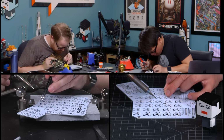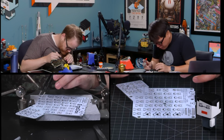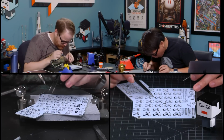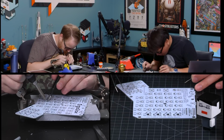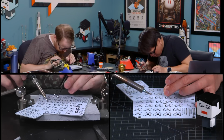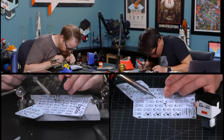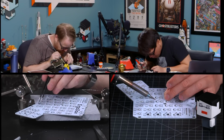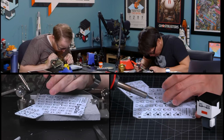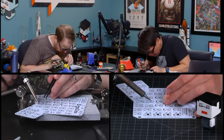How are you fixing crookeds? Are you just bending them straight? Oh, yeah, that works. I'm reheating up and there we go, returning them to the fold. It's really difficult to tell whether you have the other side soldered on when you have one side soldered, because it is locked in place. My fear is that I'll get going on these and then I'll have just loads of floating, hanging diodes on one side. I feel like that's going to happen to me. Oh no. And we have plenty of extra diodes, so...